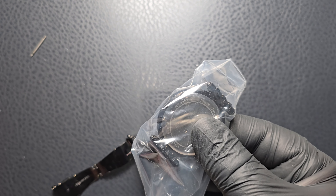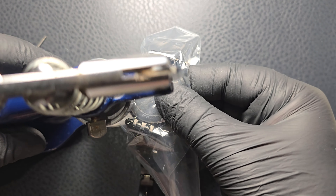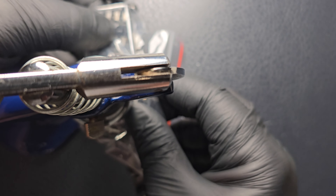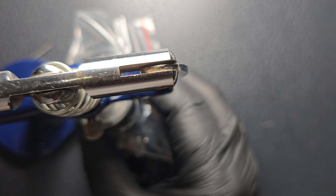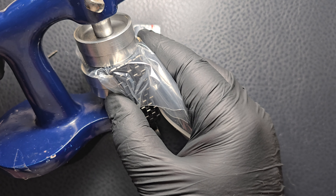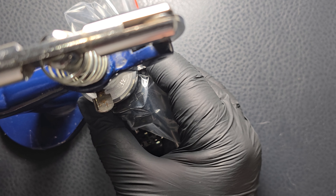Use a plastic bag to protect the watch crystal from getting scratched. Place it between the bottom die and the watch crystal before putting the watch case down between the dies. Grip the watch press handle and slowly press down to apply pressure to close the watch back. Be careful not to apply too much pressure as it could damage the watch case or crystal.